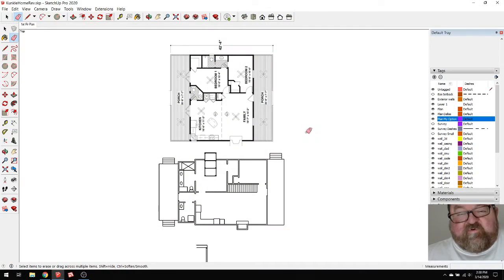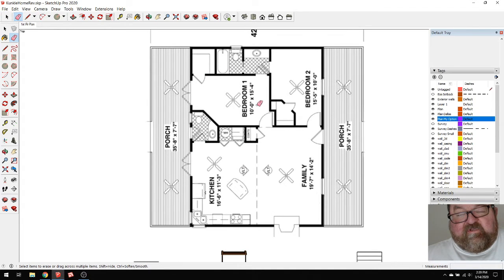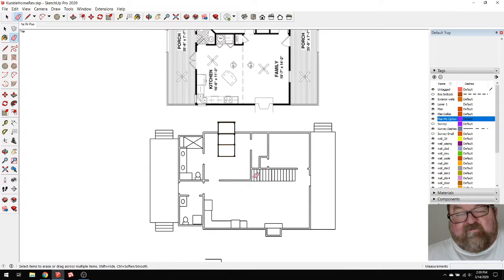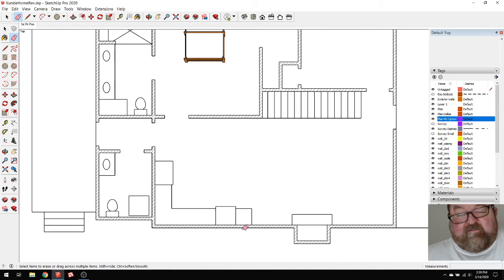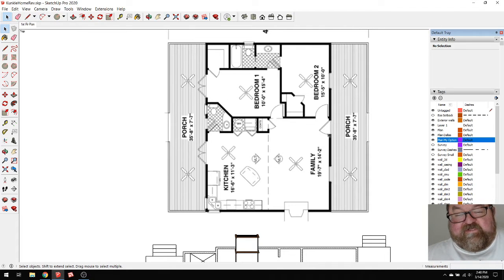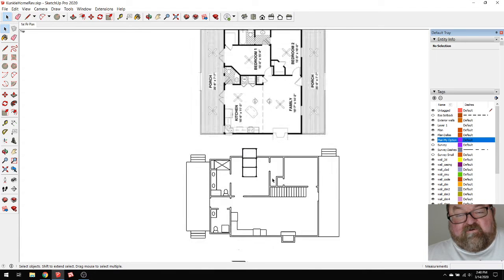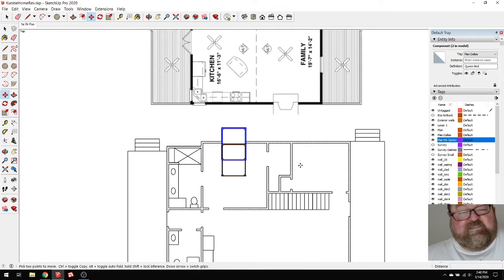So I had this customer ask me to take this plan and develop something that would have a balcony, and our balcony would be somewhere right in here, right there. The problem I see with this plan is that it's too short in this direction to get a stair run from here up to there without interfering with these entries, the entry into this bedroom or that closet.